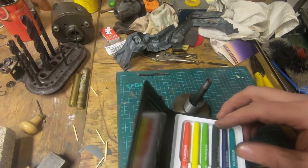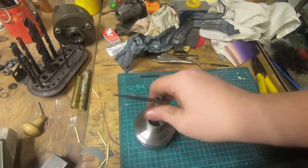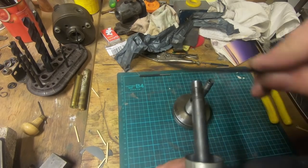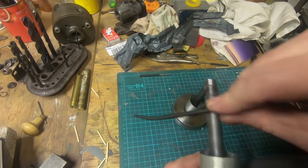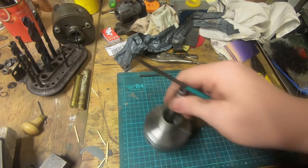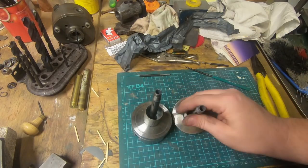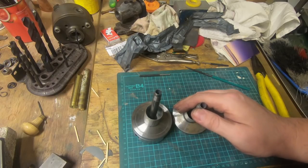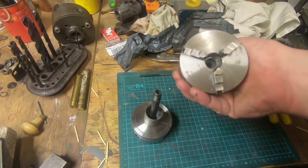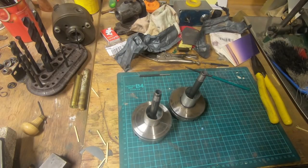I did test them — they're not as hard as I probably expected. The green hardness tester file just about marks them, which is 55 RC. That's probably about where they want to be — 55 to 56 — so I'm pretty happy with that. One of these has been dropped and is distorted on the back; I don't think it's really affected anything much, it's just a drawbar thread. But I reckon they're probably not going to bend again.